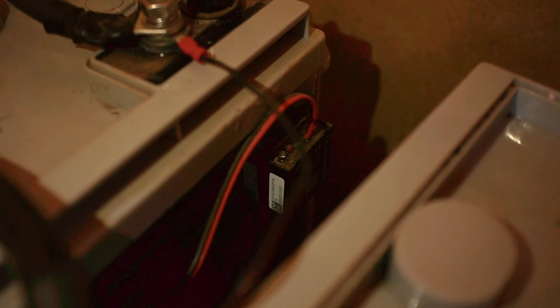Speaking of battery protection, the next thing you'll need is a Bluetooth temperature sensor for your Victron MPPT. This mounts on the side of your battery and constantly tells the MPPT what temperature the batteries are at, so it can adjust the voltage accordingly. If your batteries are hot they can overcharge, and overcharging does lasting damage. It's really important in hot climates to have one of these to maximize battery life. Ours was about 40 euros — for helping ensure the batteries last twice as long, that's a very worthwhile purchase.